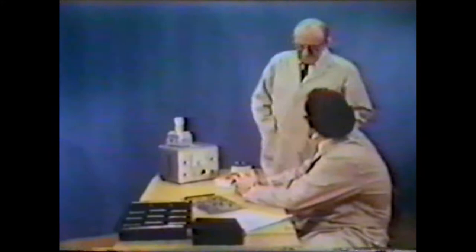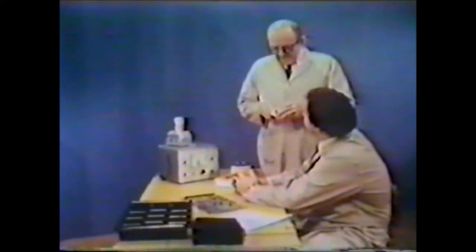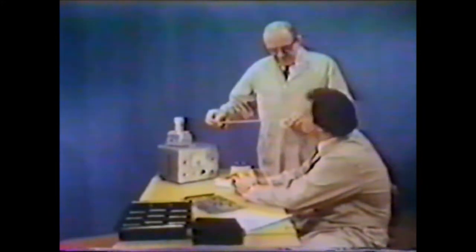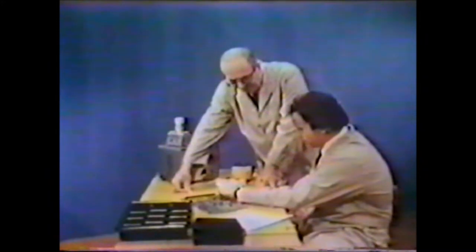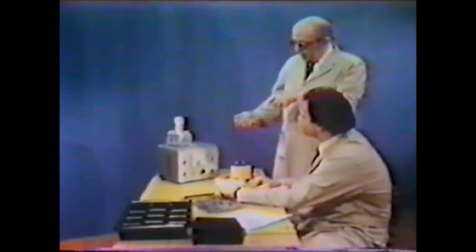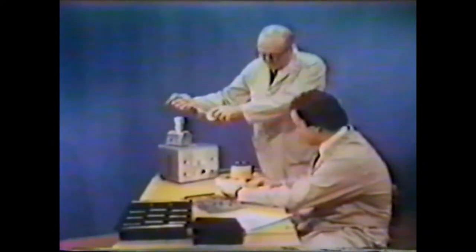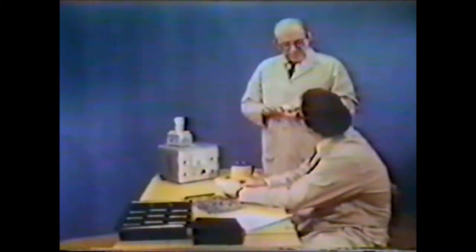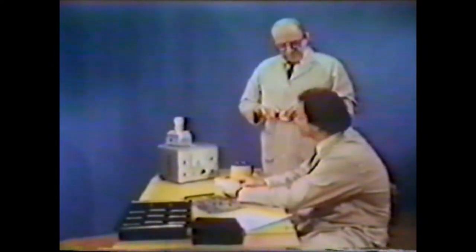Let's try this example. By pulling this tape, I've generated several thousand volts, right? Okay, now I'll ground it to our conductive tabletop. Let's check it with the monitor. As you can see, the tape still has more than 5,000 volts of static.